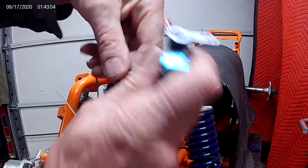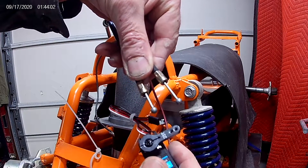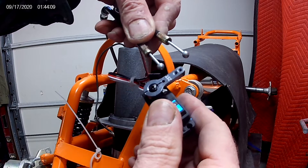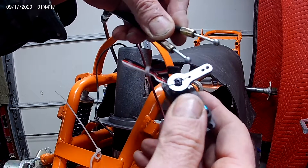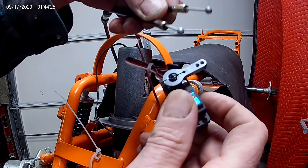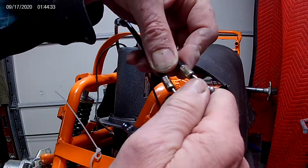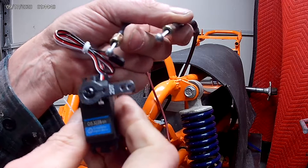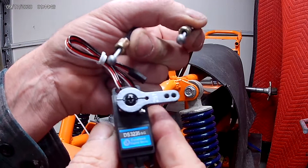I have to make some sort of bracket that holds the two cable sheathings in place, and then the cables come out from that, and this mounts somewhere here and pulls on an equalizer bar to pull them both. I would also like to have this whole thing adjustable, and I'd love to have some sort of park brake system out of this too — some way that when you shut it off, this automatically defaults to full on, but I don't want the weight sitting on this all the time. Maybe I make some sort of mechanical lever that moves the sheathing out. I would like to somehow put a park brake on it that somebody has to remove or release before they can operate it, just so they're aware that they are going to be operating it.